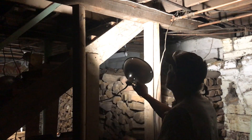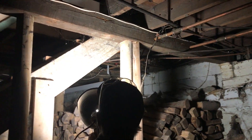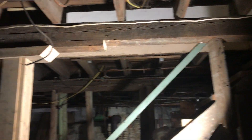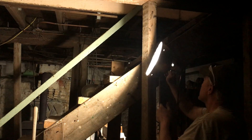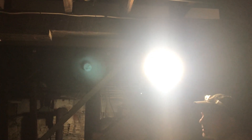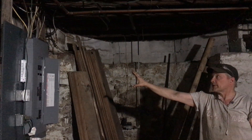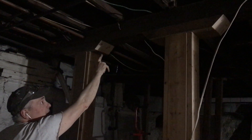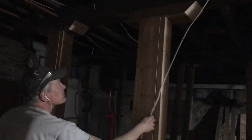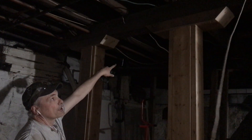We're trying to figure out how to run these wires. Our goal is to hook the bathroom in, which is that top wire I've rerouted and stapled up there nicely. The problem is the original wire, when this was the old service, came up right here and there was a junction box here which was really not a good one at all. Once I rerun the wires, I can't put the junction box where I would like it if I want to hit that other wire.